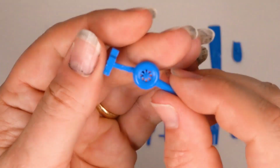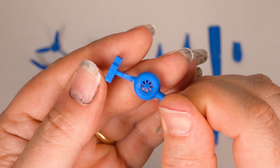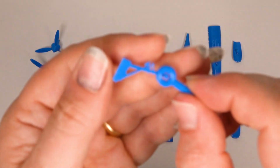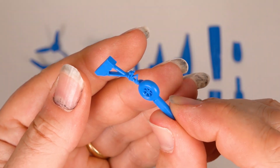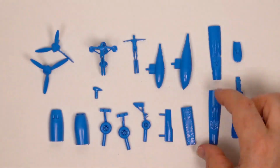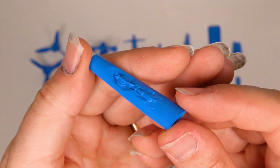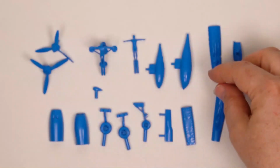My main success was with the undercarriage. The detail is excellent, everything I hoped for. Once cleaned up, they'll go straight off to the bronze casters. They normally take about 3 weeks to make the moulds and cast the parts using the lost wax process. I'm planning to make metal masters of the turbo superchargers and add them to the ABS wingmaster. It should work out fine, I think.